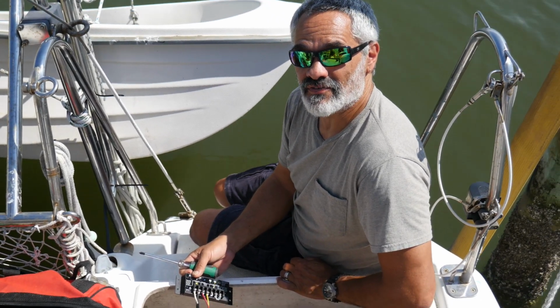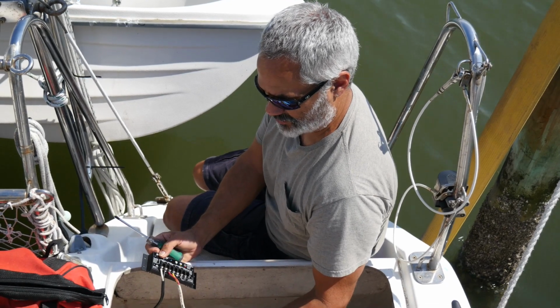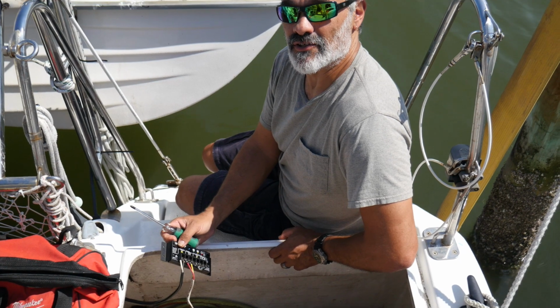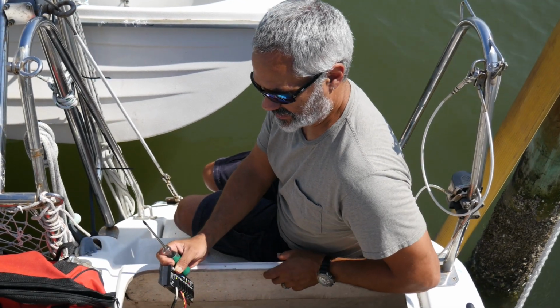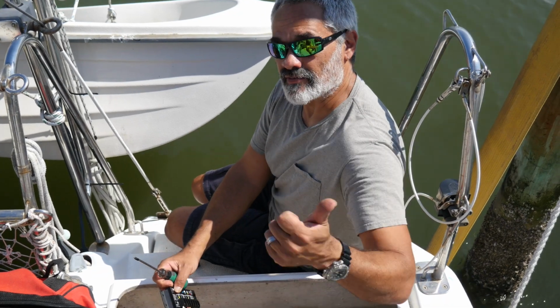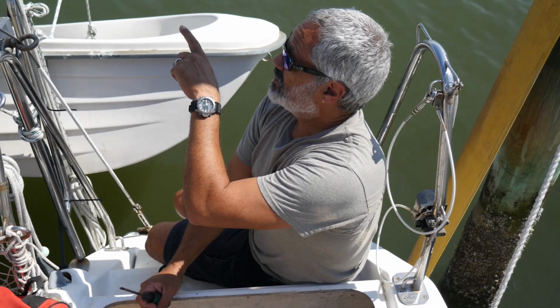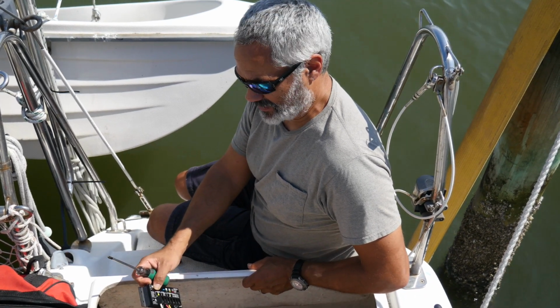And it's not worth videoing because I'm going to be upside down, but I'm going to take this excess wire, put it into a loop for being able to do this 50 more times over the next 2,000 or 3,000 years, and screw this back up to the bulkhead, and it'll be all done. But as we speak, if Pierre turns on the control switch on the inside, assuming that the panel is live and the batteries have water in them, there'll be juice and the batteries will start charging. So it has been a true pleasure.